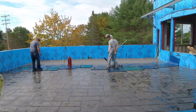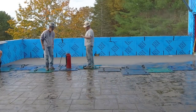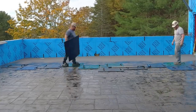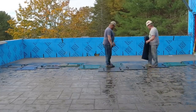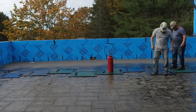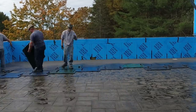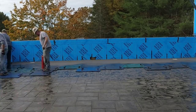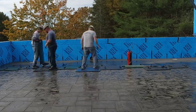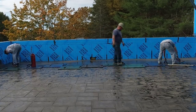On a commercial project like this we all have to wear hard hats — we don't typically wear them on residential jobs, so we broke those out for this one. It did cloud in a bit — the sun kind of went away — which really helped us. We haven't had to use a tamper yet; we can just use the weight of our bodies and feet to get really good texture in. You can see the black charcoal on the release, which is going to give this a really nice two-tone effect. The temps were in the 60s today, getting into fall — you can see the leaves in the background starting to change.